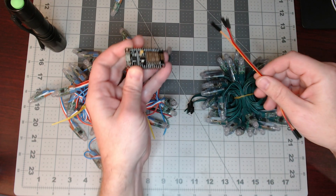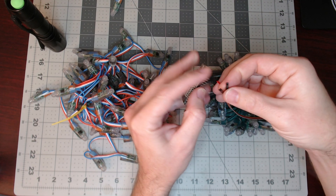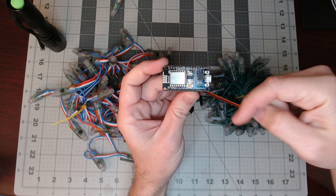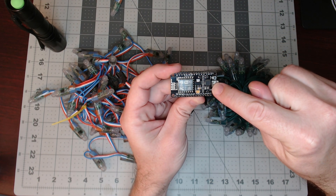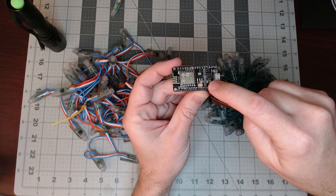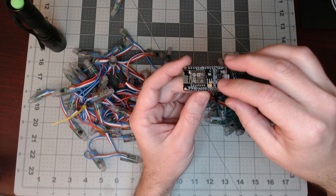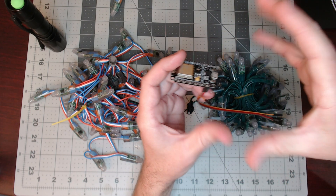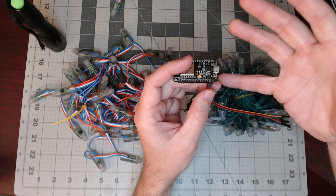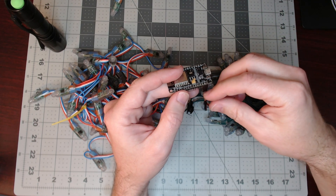In this situation, we do need the NodeMCU, and we had it running off 12 volts. If you do get one — links are down below — there are a bunch of NodeMCUs, but do make sure it has the AMS1117 and also the CP2102, like the ones I linked. Do not get the fatter ones with the CH340G. Some people had overheating issues, getting up to 60°C. I found these get maybe 35 to 40°C under load with 12 volts, but with this solution we're going to run them with less than 12 volts, so they'll run even cooler.